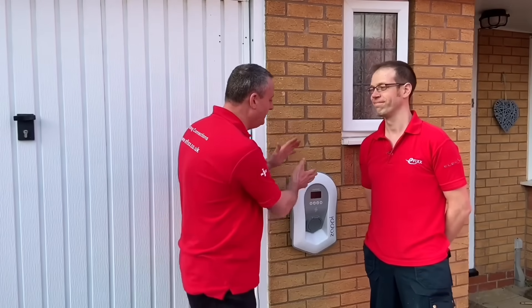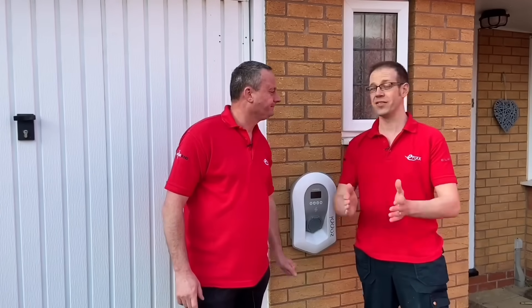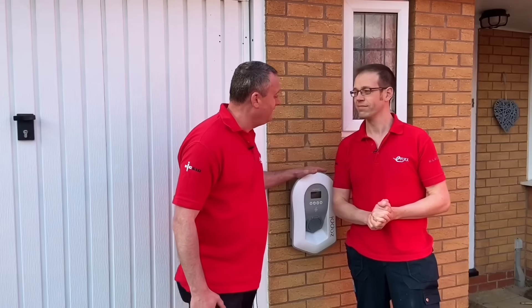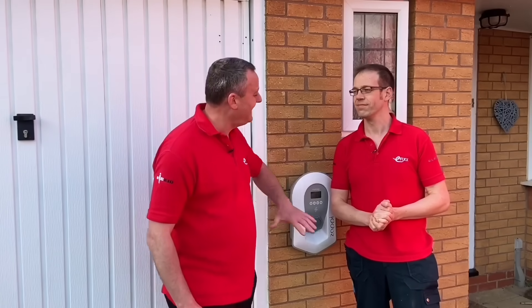So we can see this wasn't a simple case of just taking a cable from the consumer unit to the end point — there was a lot more involved. The installer made informed choices: installing a new consumer unit to introduce surge protection, keeping everything away from that AC RCD to avoid it being blinded by DC going back into the system, avoiding selectivity issues, and installing the cable in such a way that it didn't require RCD protection — knowing that RCD protection is already inside the EV charge point. If you want to see more EV videos, we've done one on how to test an EV charging point, stage by stage, which is worth checking out.